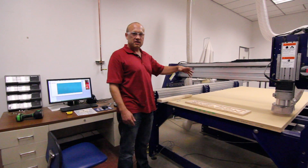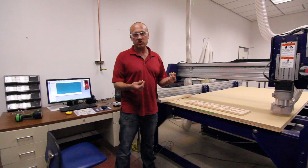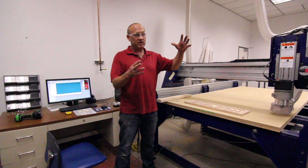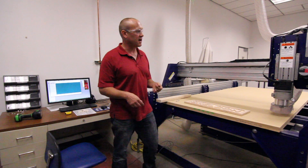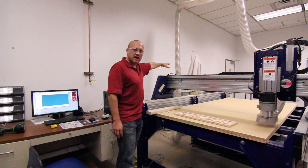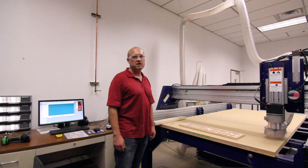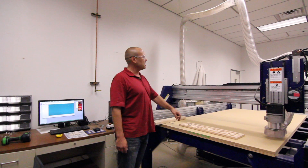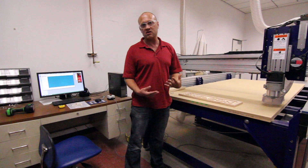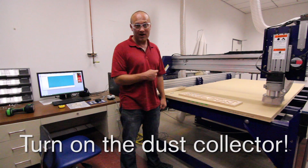So with the moving carriage in X, Y, Z, cutting wood or plastic is going to make particles — especially with wood, sawdust. Sawdust is dangerous, believe it or not, in an environment with electronics because it makes dust and powder. Because of that, this machine is hooked up to a tube system connected to a dust collector, which does a fantastic job of sucking up almost all of the dust and debris. Up at the ceiling there is the dust bag, and it can get filled, so as you're working you may want to check whether the bag is full. Also, make sure the dust collector is on when you're working.